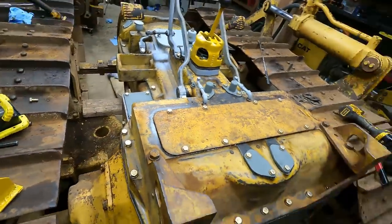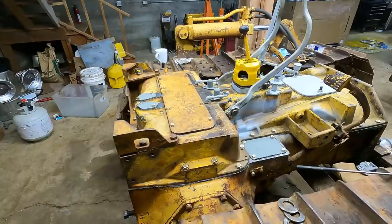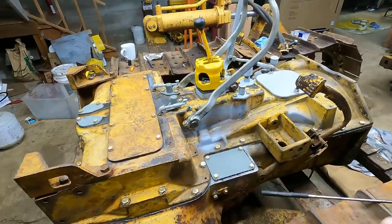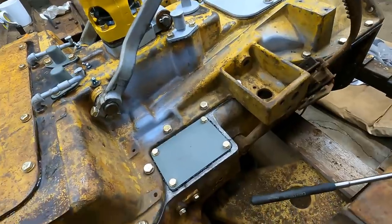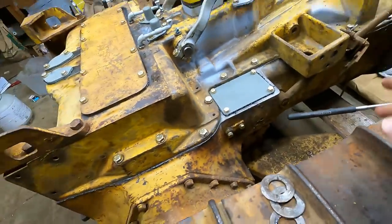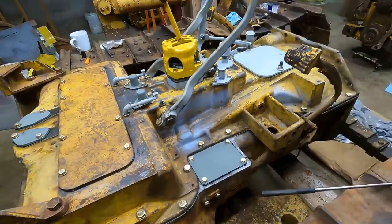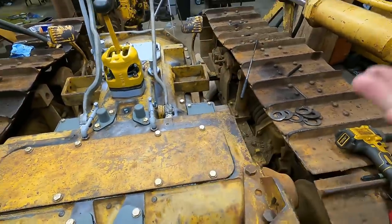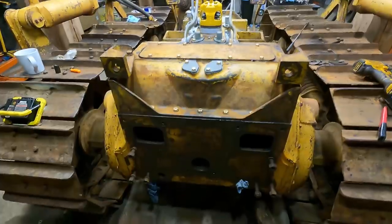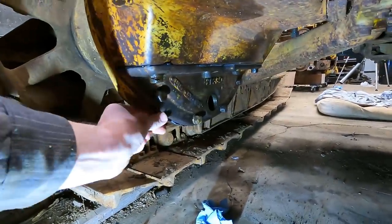In the previous video I adjusted the brakes before the cover was on — that was dumb, don't do that. Basically you need to put these pedals back in, which I've done. The stop is the actual case, so you have to adjust them once it's all back together. It's just a 9/16 socket that goes right in there, or there's probably a $400 Cat tool. Down here I reinstalled the cover. There's still some RTV barfing out of there — that's fine.